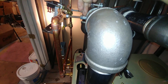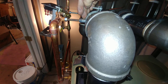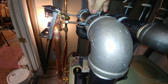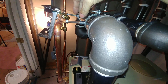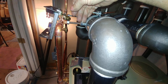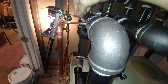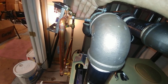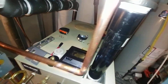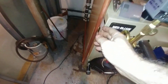The nice thing about the two-and-a-half inch and higher size is that it actually comes with three-eighths all-thread. The ones you usually get that are cast come as half-inch thread in the two-and-a-half inch split ring size, which means you have to get an adapter and cut little pieces of half-inch thread. Three-eighths inch size is bog standard and easy to deal with.